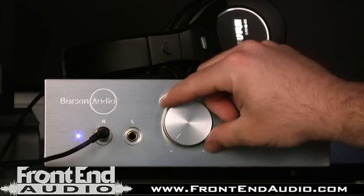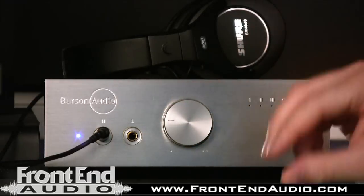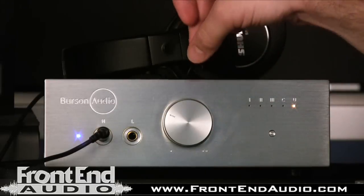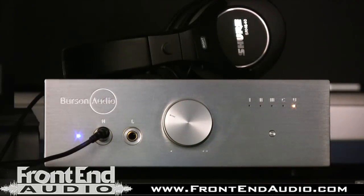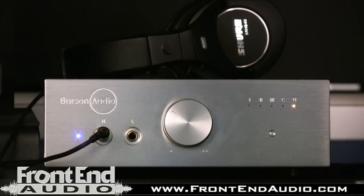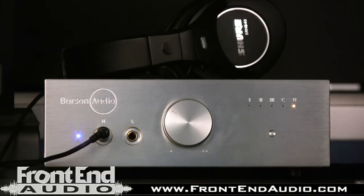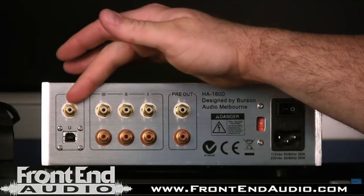The potentiometer here really is a stepped attenuator, but it's not just stepped. It actually is a discrete stepped attenuator, meaning that it has actual resistors wired into the circuit path. So it maintains the shortest circuit path possible. And as a design, it's expensive to create. It is something that you would find more in a high-end recording console, like an older Neve console, like an 8078, 8068.